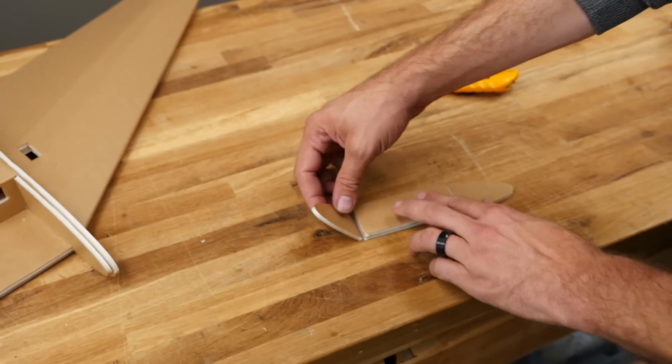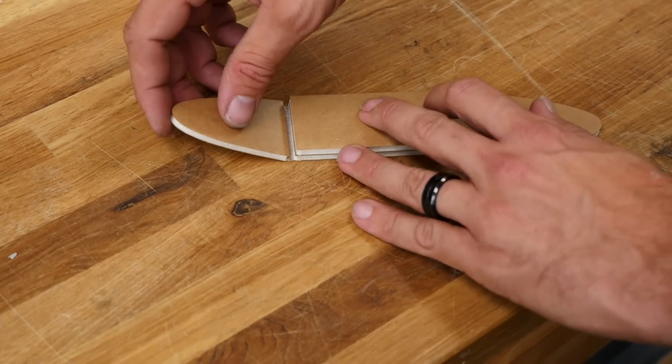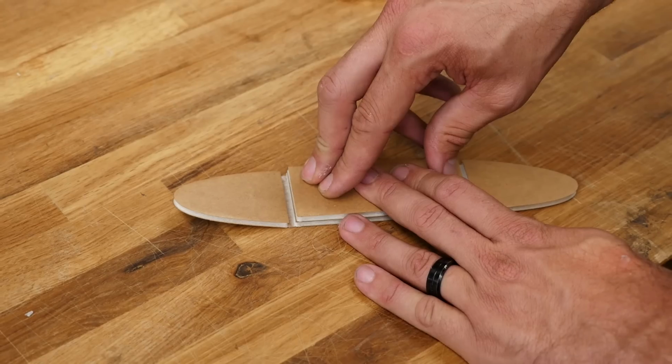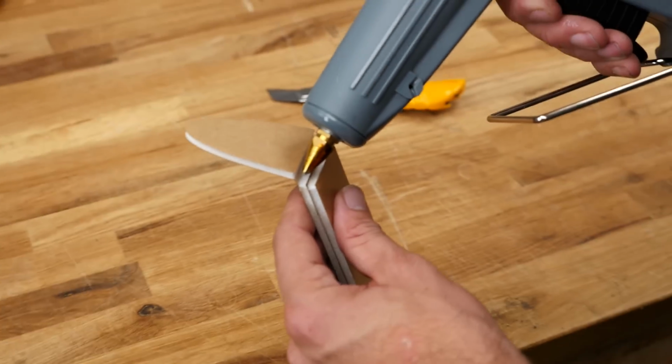Once you have that fit, this is going to be our first B-fold. Now, unfortunately, I couldn't put a B stencil on here because we just covered up the bottom plate. So the B-fold is where the side plate is beside the bottom plate, just like this. So the bottom plate is staying on the ground, the side plate moves up. Exact opposite of the A-fold.